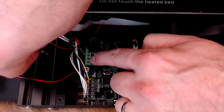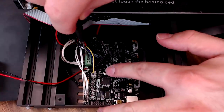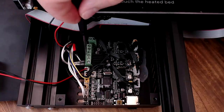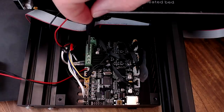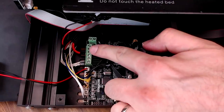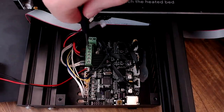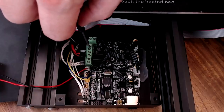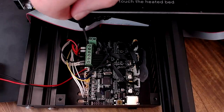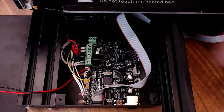The first set of terminals is the hot end heater - you don't have to worry about polarity, it doesn't matter which wire goes where, just make sure you get those terminal screws nice and snug. The center set of terminals supports the bed - these don't have polarity either, but it does have one red and one black wire, so positive on one side and negative on the other. These are the most important ones to make sure you get nice and tight. The last set is a constant 12 volts where we park the hot end fan - the negative terminal first, and the one closest to the power input is the positive.